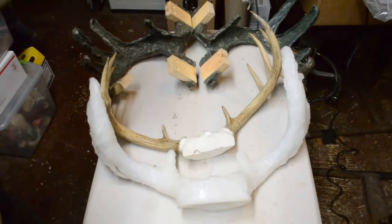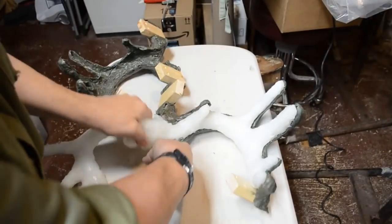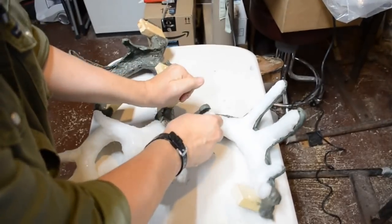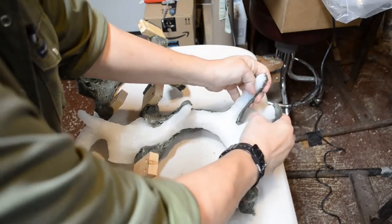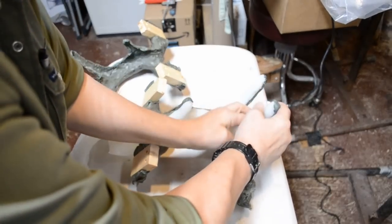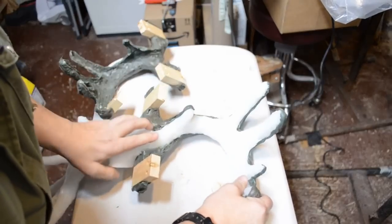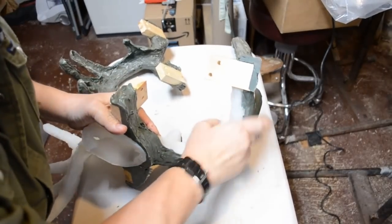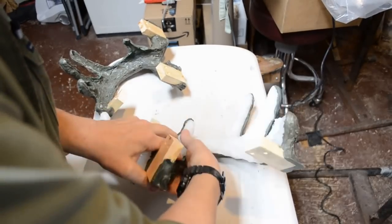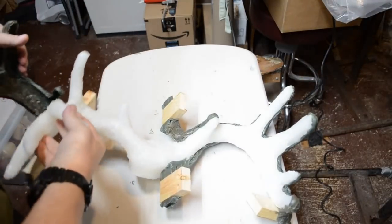The next step will be to demonstrate how to pour a urethane casting. Okay, now this gets worked back into the mother mold. The tines are placed in their respective little holding areas in the fiberglass mold. Press this back in. Make sure it's good and tight. Check. Make sure she's in. Okay, that's one side. We get the other side hooked up, same way.